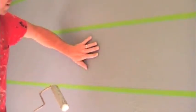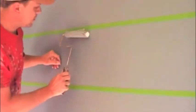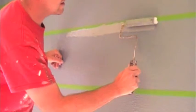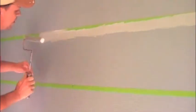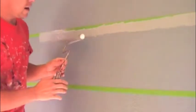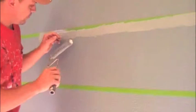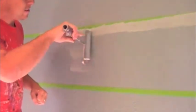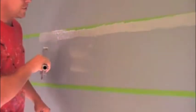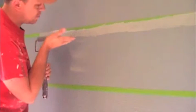On this area, I'm going to paint a different sheen — same color as the wall. I'm going to use a roller and sneak it up to the tape, kind of shove the paint up there so the paint seals under there. Then I wait about an hour, because the paint underneath takes longer to dry since there's no airflow. Once that little section is done and dry, I can roll on a different color or sheen, then take the tape off.